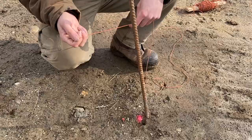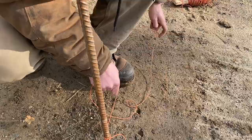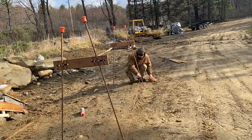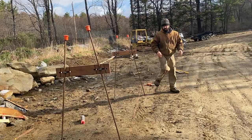The last thing here is to set the strings. There are all different techniques and knots you can use — a quick double-wrap knot works well: cross over the bottom one, and as long as there's tension on that knot it's going to hold. The string has to be on the inside edge of that rebar, otherwise the rebar is going to force a groove in the stone wall as you build. Sometimes it's nice to have separate lengths of string between each frame so you can keep moving each piece up independently.